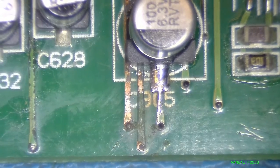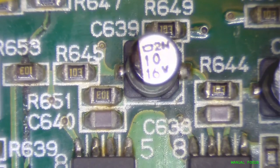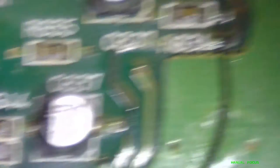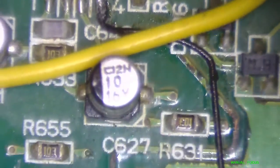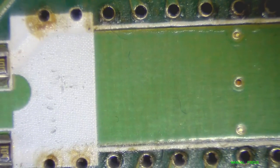Okay, I think that's enough on this. The next part of this will be stripping all these caps off the board and seeing how bad the pads under the caps are, putting new capacitors on here, restoring some of the resistors, cleaning up as best we can, and jumpering up these traces where they're not making connections. Then after that, I'll put the regulator back in, put these ICs back in, and try it in the receiver again. I can't see that being relatively soon because I'm still waiting on some parts.